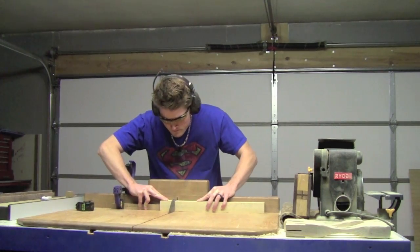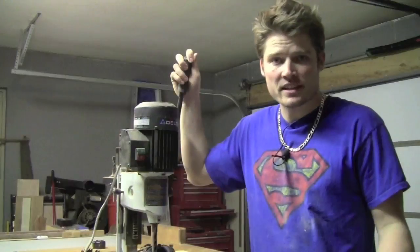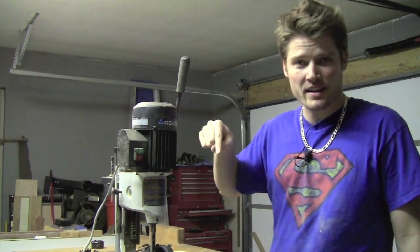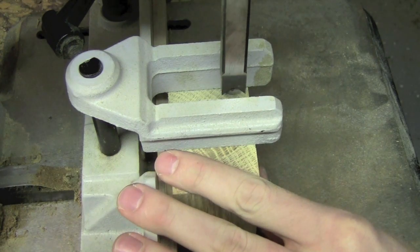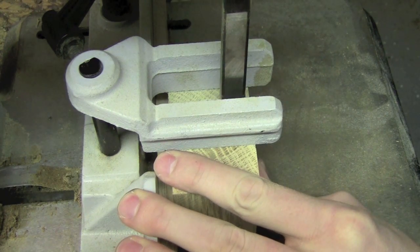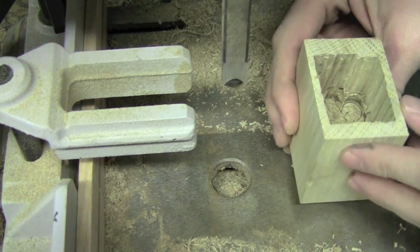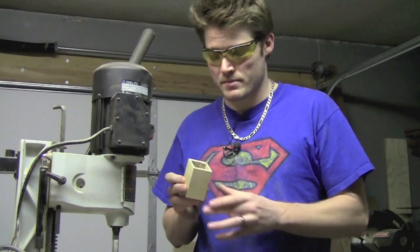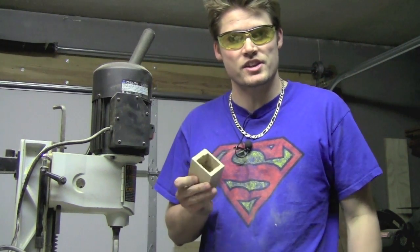Now is go ahead and cut the stock for the actual heads. You can see my hollow chisel mortiser is now in place because my drill press is so ghetto it won't even drill through oak. Now I got the big boy out and we're gonna hog out some material. Now, the clean out of this hole doesn't have to be very pretty because it's going to be covered up. All it's supposed to do is just hold that steel shot.